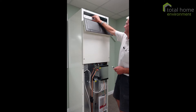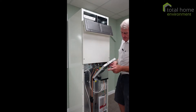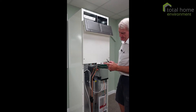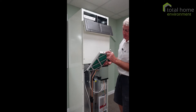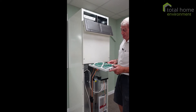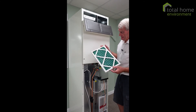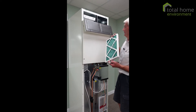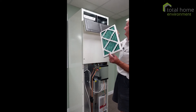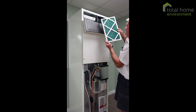So we have two filters. Let's start with this one which is the G4 filter. There is an indication arrow on this and the airflow is always coming down, so the filter arrow must be pointing down with the airflow. This one as you can see is quite clean. It's a pleated paper filter and all it does is keep the internal parts of the machine clean. The air passing this side of the machine doesn't go anywhere near you — it's leaving the building — but we need to keep the heat exchanger clean, which is in here, and that's what this filter does.